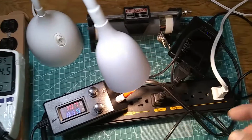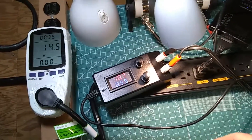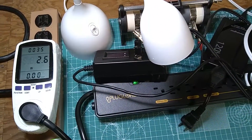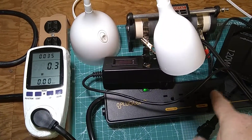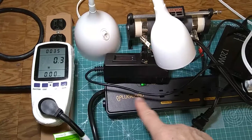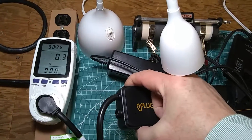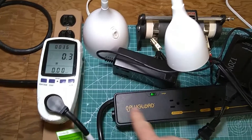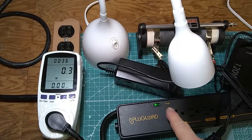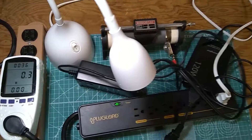Since this uses a switch-mode power supply, there's no flickering or problem. But keep in mind there's a slight delay — about two and a half seconds for the outlets to turn off after the control appliance is disconnected. Overall, this is a very good strip. The only downside is it doesn't have a power switch, which most others do. However, it has a 15-amp circuit breaker, nice surge protection, and the standby consumption just to light the LED is 0.3 watts — which is a bit much in my opinion. Thanks for watching!